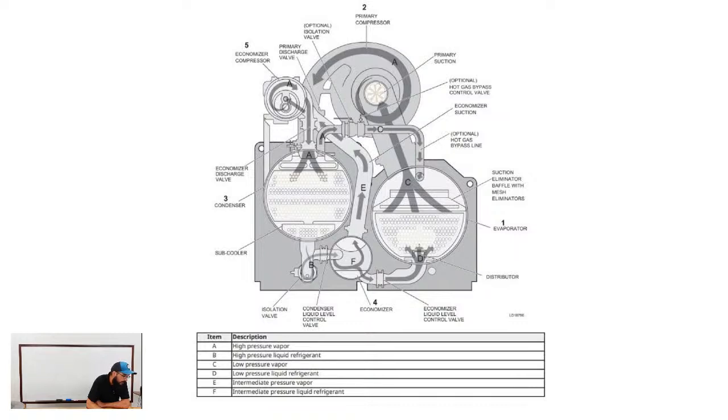Anyway, so we use hot gas bypass here in Arizona for the winter months. We have to oversize, and there's so much. Yeah, that makes sense. Hot gas bypasses are very effective. I think the centrifugals themselves can unload, depending on the machine, down to 40 to 30% of their capacity on most of them. And then if you have a hot gas installed, a lot of times those can get you down to like 15, 20% of capacity. It's incredible how much it can benefit you.